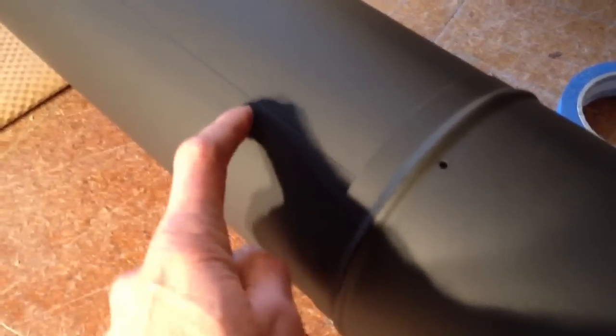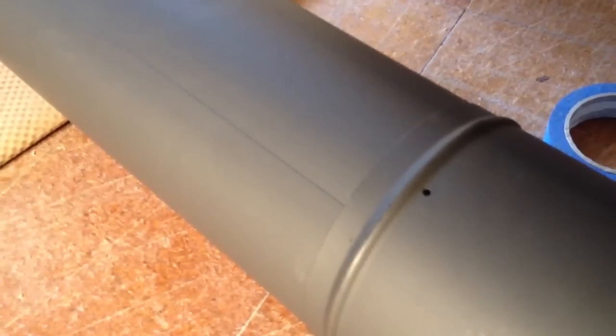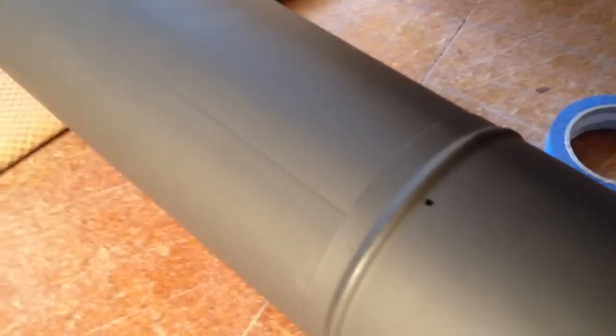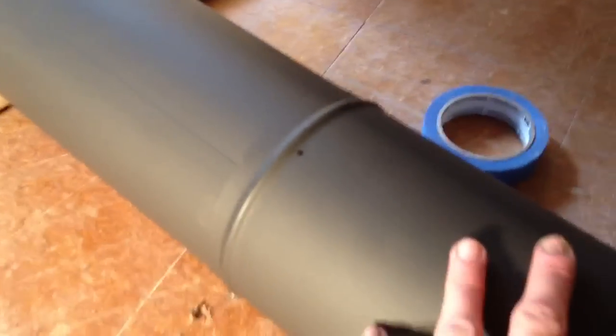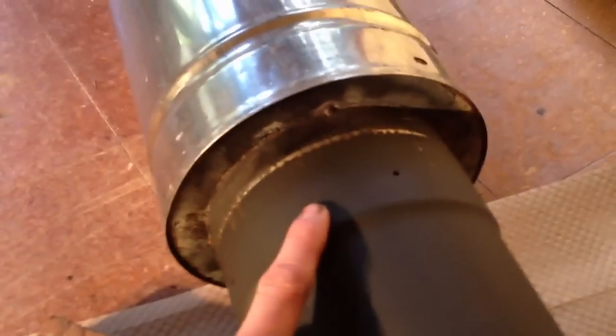But what's more important is the creosote that collects on the inside of the piping wall — it drips back down into the furnace. And if the upper piece went over the top, it would drip on the outside, which isn't good. So that's why it's always the upper piece that goes inside the next piece down.